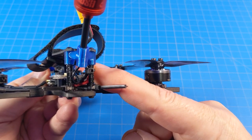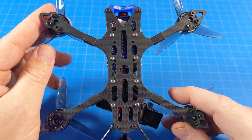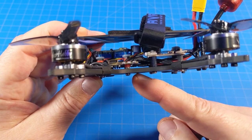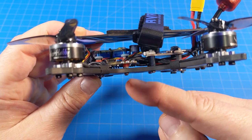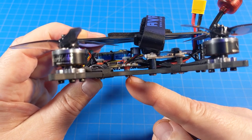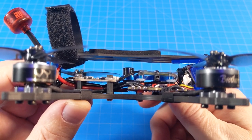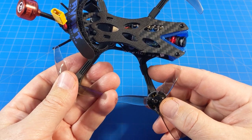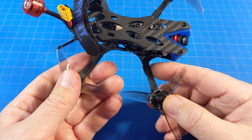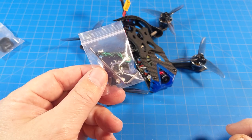The battery lead is zip-tied down to the rear standoff, antennas are extended just outside the frame. It's a unibody design and each motor is mounted with three screws. Metal is used to secure the flight stack and VTX — no nylon — which I appreciate. Here's a closer view of that TPU mount holding the capacitor in place. Motor wires are secured with my favorite tape — I call it emax tape, others call it gaffer's tape. It comes with the mount adapter that every Ratel comes with.